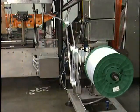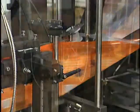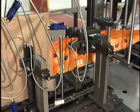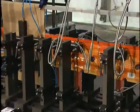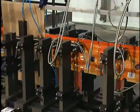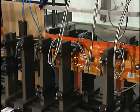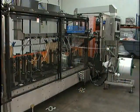After zippers have been added, film stock moves through a dual sealing station that creates side and bottom seals. It then travels through three heat sealing stations that hermetically seal the ends of the zipper to the pouches. A fourth station cools and sets the seal, and a fifth cools the side and bottom seals, preparing them for cutting.